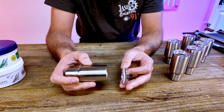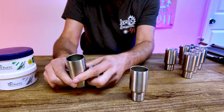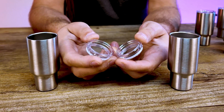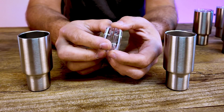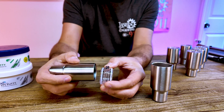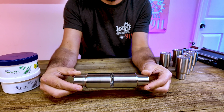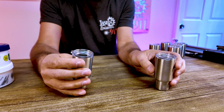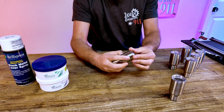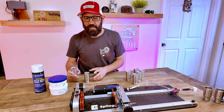What I thought — and I've done this before with other cups — is if I can take these two lids and glue them together without actually gluing them together, because I don't want to ruin the lids or use tape or anything, then what I have is kind of a fixture that holds two of them at once. And then I can actually do two of these in the rotary at once. Time is money, right? If I can do two at a time, that's even better.